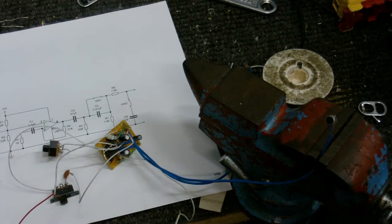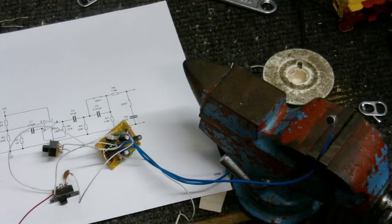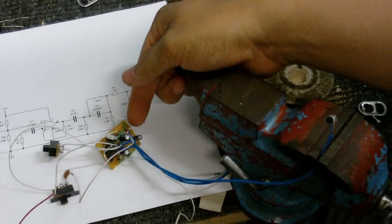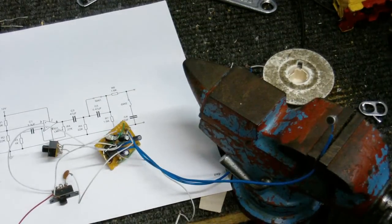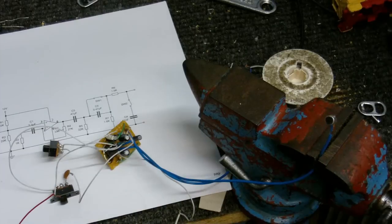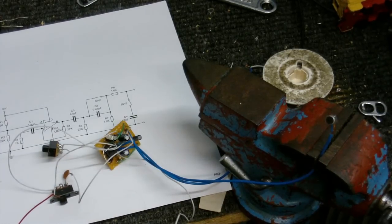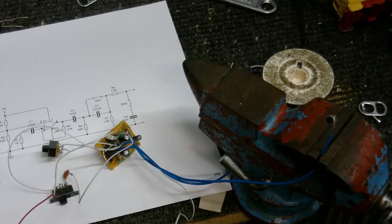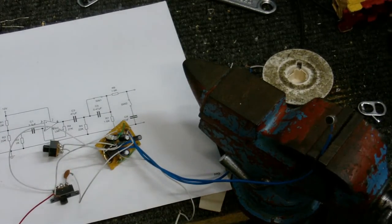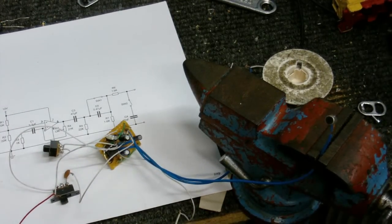And as the microphone was getting a little bit more voltage than what I wanted it to, I've changed this resistor here to a 10K. Hasn't really lowered the microphone's voltage. It's gone down from about 11.4 or whatever it was to about 10 volts at the microphone now. Still a bit higher than what I wanted, but I don't think that's going to hurt it. And if you haven't guessed, yes, you are hearing from the preamp, directly from the preamp. And I must say, I think it sounds pretty good.